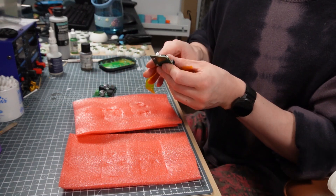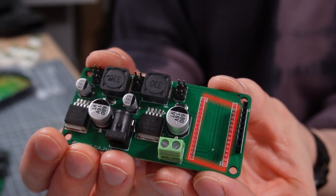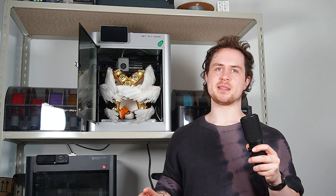I was, however, quite astounded to realise that I'd made the same mistake twice and gotten the whole pitch for the Arduino mounting position wrong, so I couldn't just plug it in neatly — I had to solder on jumper cables and wrap them underneath the board and have the Arduino kind of floating in there. So in true Will Cogley fashion, it did end up being a bit of a rat's nest of cables anyway. Thankfully, the PCB did exactly what it needed to, and supplied the power to the servos consistently while staying cool.